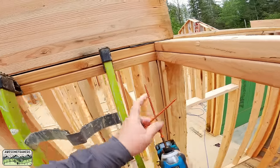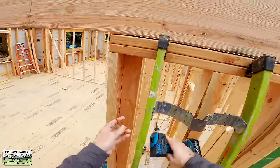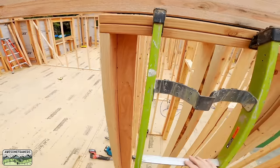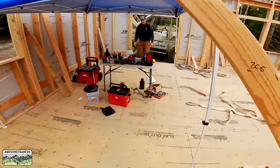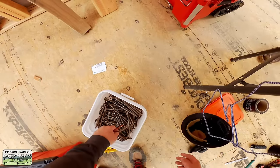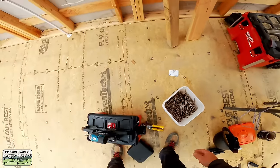So technically the bearing is to the right, and that's why you can see a bit of a gap. That's the camber from the glulam. I'm attaching it with Strong-Tie SDWC. They're really made for trusses and so on. I think I have a video on my channel if you wanted to see that in more detail. But we fasten it with those because it's easy. They don't split. They have a ton of uplift compared to toenails and nails. And if for any reason we need to move it, we can. They zip in a little quicker. It's thinner, and because it's fully threaded, that's why the head doesn't have to be so big.